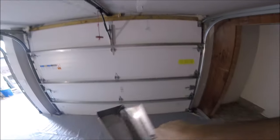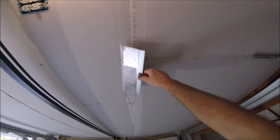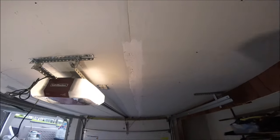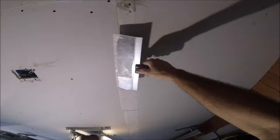I'm going to show you an easy way for beginners to drywall finish a ceiling. I found that using the 12-inch knife can really help a beginner get the mud up there and get the tape bedded right off the get-go. You just want to get your mud up there — fill your knife not completely full of mud, just kind of control it, keep it in the center, and you're going to come back and wipe it down.